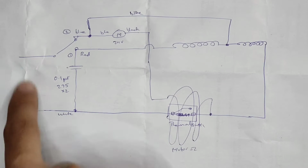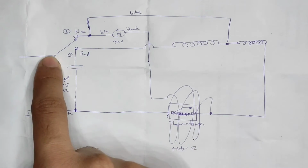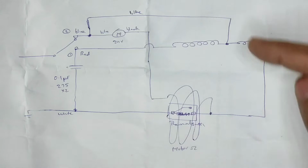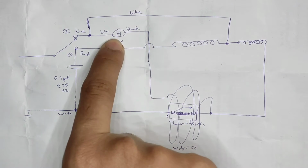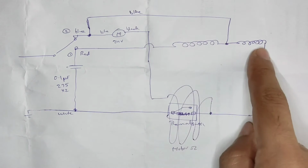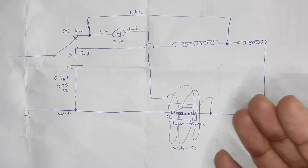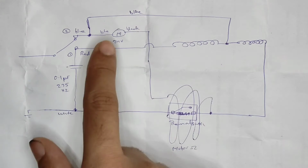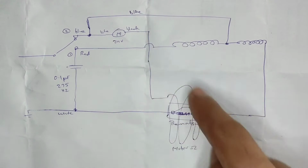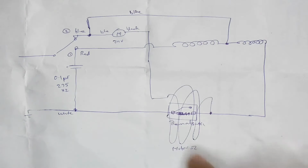These are the two wires coming from the AC mains side, the white and the brown one. This is a switch that we have already discussed. It's a common point, and these are the two points. This is the first mode for the lower temperature. This is the second mode for the higher temperature. I hope everything is in focus. This is the 24 volt motor, and these are the three sets of coils which I mentioned in the previous section. The two sets of coils are for the primary heating, and the third section is for the auxiliary heating as well as for the DC series dropping for the 24 volt motor. This right here is the capacitor which you have seen, and inside the coil for the motor is the thermal cutoff switch. So now that is the physical overview of the schematic, let me explain how it all works.